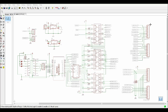Okay, so let's quickly go through the various bits. The actual button matrix, as well as the display, will then not plug into the machine's default controller board, but I'll unplug that and plug that into this controller board. These incoming data lines will feed in over there, straight into my Arduino. So you'll see there's column 1, column 2, row 1, row 2, row 3 for the 6 buttons which come in as a 2 by 3 matrix. Those get fed straight into the Arduino.